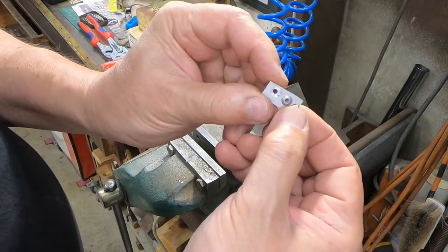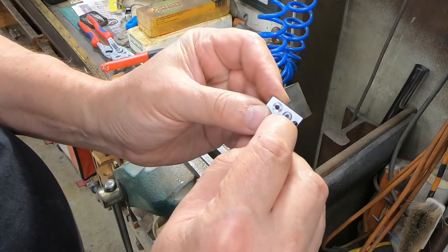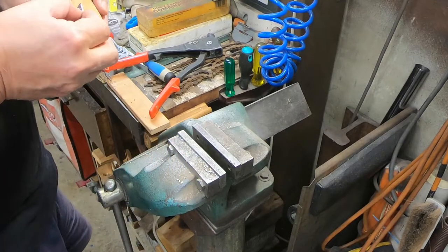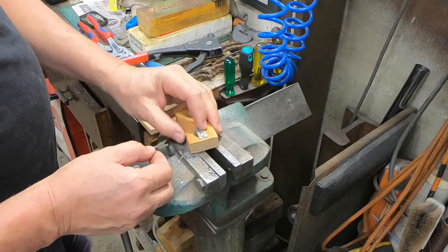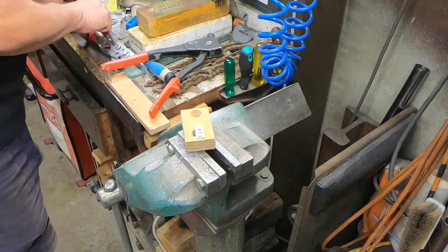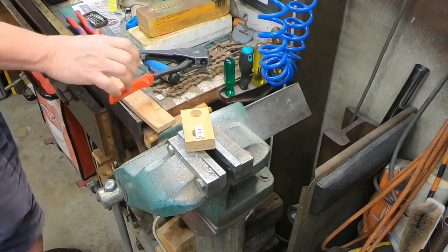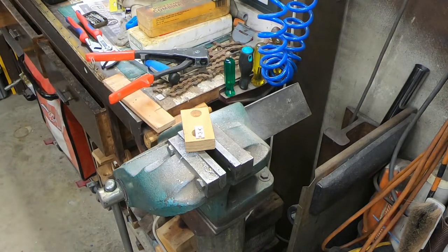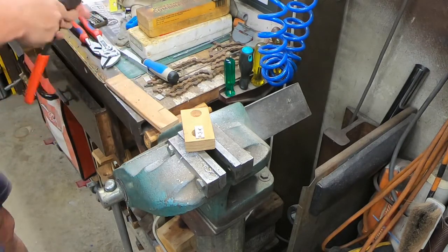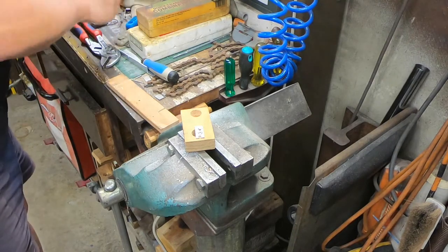If you look really closely, you can possibly see the back end of the ball in there. Now that's important, because if you go to drill it out, the drill is going to get held up by that steel piece. So the tip: knock that pin through before you try and drill the hole. The easiest thing to knock it out with is a discarded pop rivet shank. There's one still in here, if it'll only come out. Come on, come out. There it is.